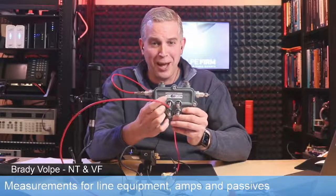expected to get. And if the modem has enough power level to overcome it, it'll work, but then you'll be scratching your head saying, why is it transmitting so hot? What's going on, or why is the stuff downstream not working? So that arrow on the tap that shows the direction of signal flow is really important.